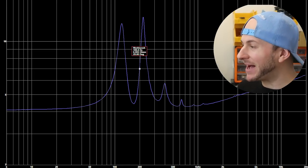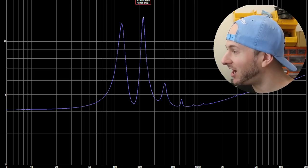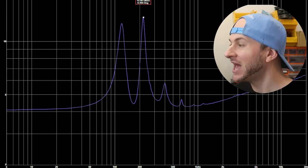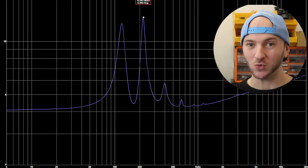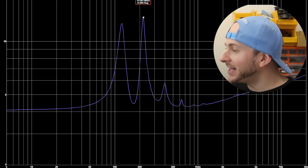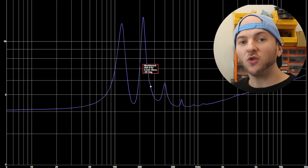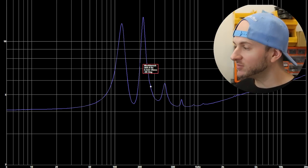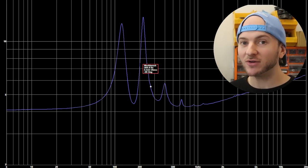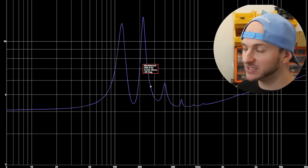So I hate to think how bad it would have been up at where this next impedance spike is, which is at a hard 222 hertz. I think playing that frequency, the cone would just want to rip itself apart on about 2 watts. Now the next frequency up we play is a 270, which is 45 scaled hertz, and that is on the way down to the next impedance dip. We are at 5.5 ohms, so again we're going to be loaded fairly well down there, but not making full use of the horn load at that specific frequency.